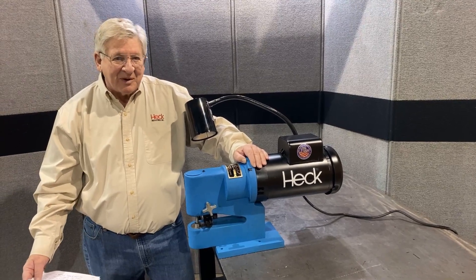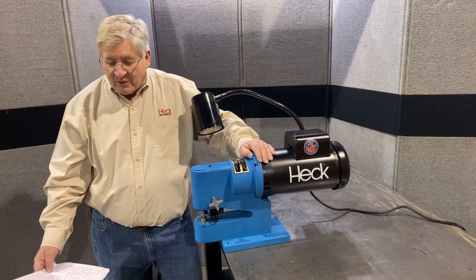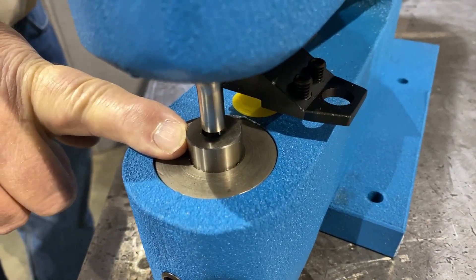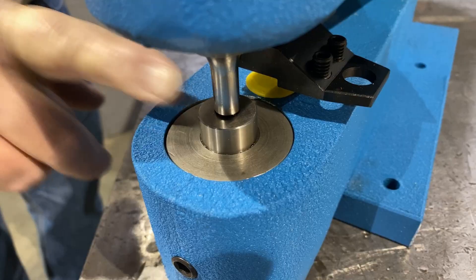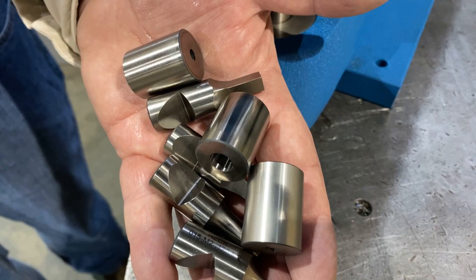The Tracer Punch nibbling machine will cut up to 3/16th mild steel, aluminum, or soft plastic, following a template as a guide. The machine uses a precision high-speed steel punch and die hitting 27 times per second to make a clean continuous line cut. Various size punches and dies, round and square, are available down to 1/8th of an inch.